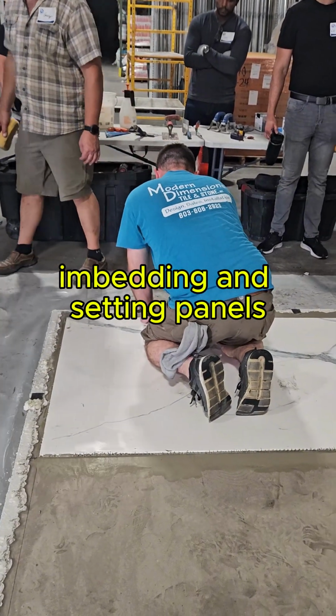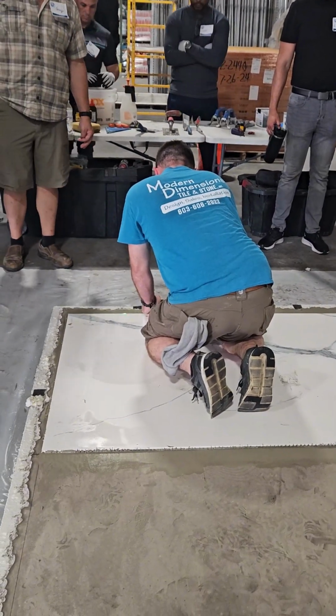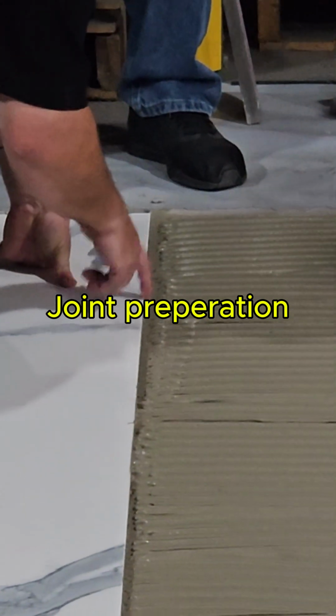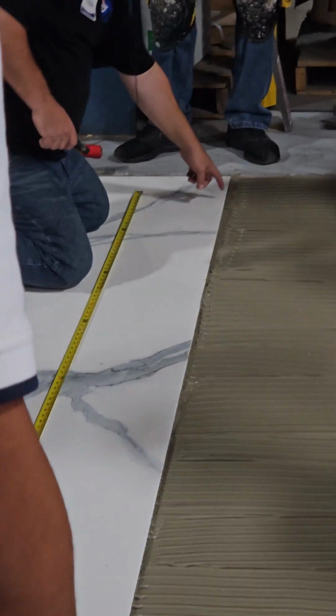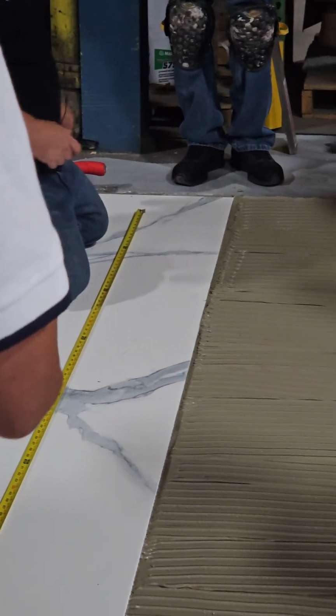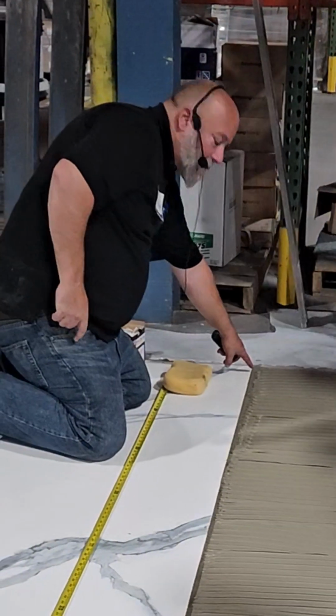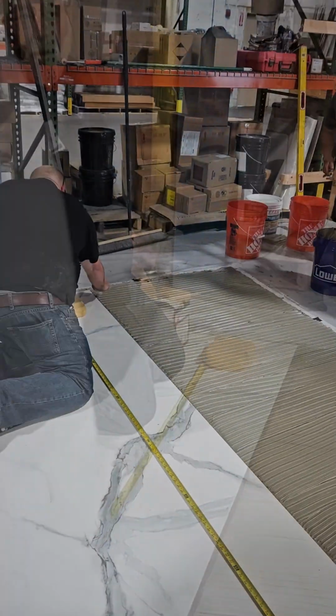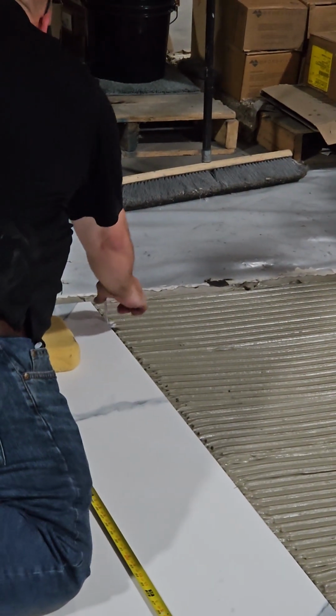And if you look at all this mortar he's oozing out. See that? He's pushing that air right here. See this void? We didn't get quite close enough. There's not enough mortar here. Get mortar all the way up to the edge. All right? You see this edge? That edge is very, very vulnerable to being broke. And you just want to slide it in just like this.